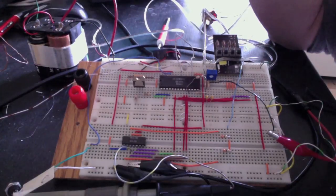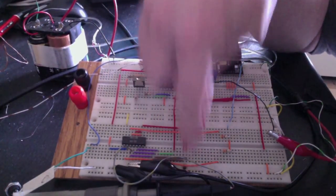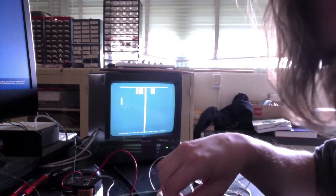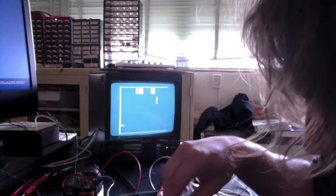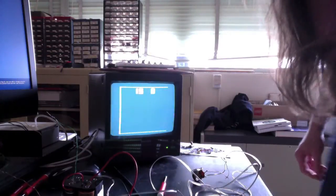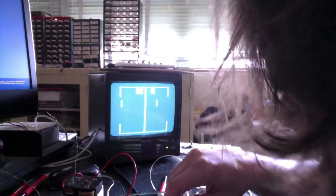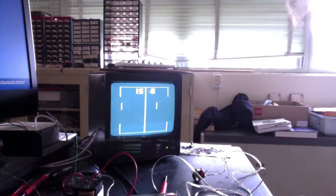It's pulsing at about 2 MHz, so we can pick it up on the TV. And you can see all these pulses go into a NAND gate. All the outputs come out and go into our TV. And now you can see different games depending on where you are — I think this is like squash. Foosball. And now I'm going to turn it over to Sam.